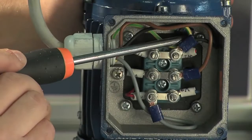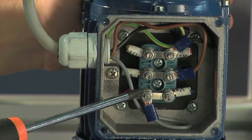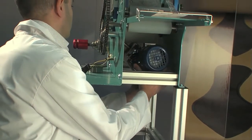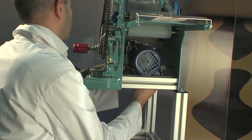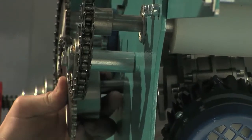Reassembly. Reconnect the power cables, three-phase and earth, on the engine — put them in the same positions as before. Place the gear motor in such a way that the shaft goes through the machine wall and insert the gear under the drive chain, with the grab screw hole facing up. Align it to the gear motor output shaft.